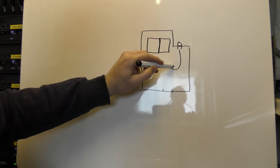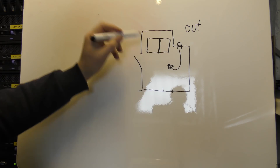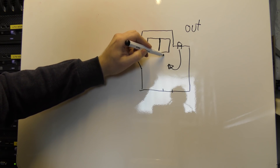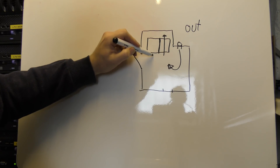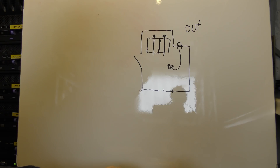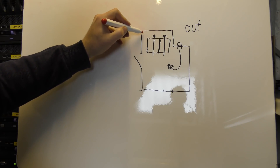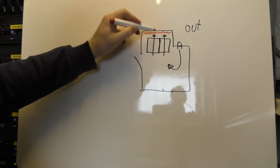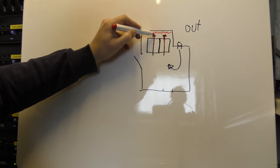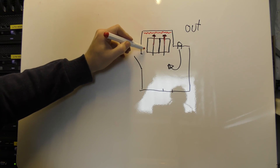The air comes in from outside, and when you mount a server it will blow the air that way — all of them. You might have some switches too, we'll use different colors. The back here becomes hot — red color, awesome. So the air becomes hot going through the servers, and I've closed things off so the hot air is captured on the back of the servers.